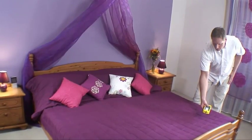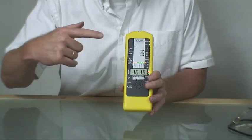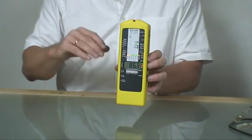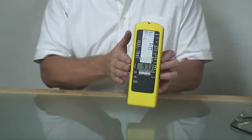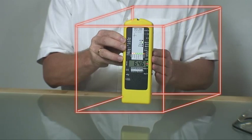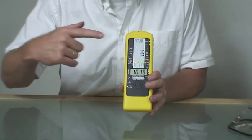The symbol of the 3D coordinates explains the three axes of the meter. The electrical field plates are located right under the four housing sides and are digitally transformed into a perfect E-field cube. The isotropic point for the magnetic field is right under the coordinates printing.